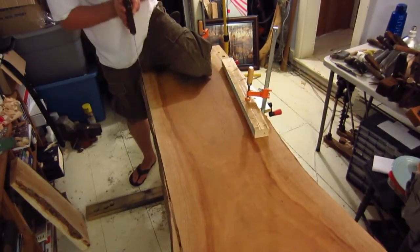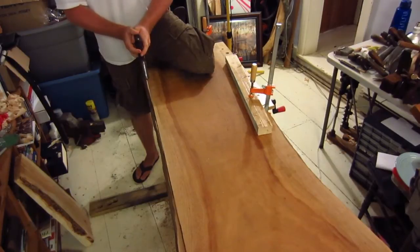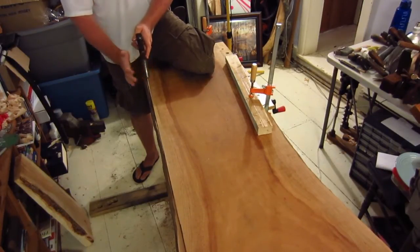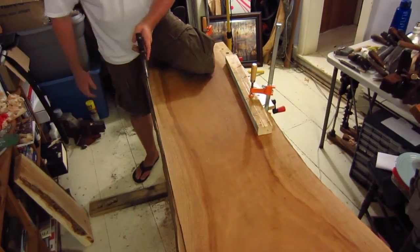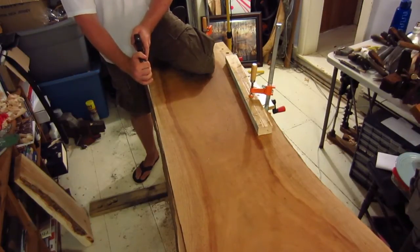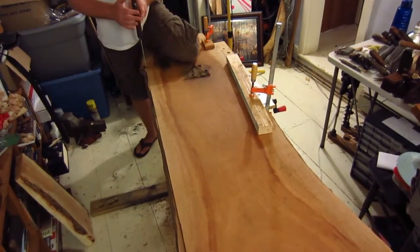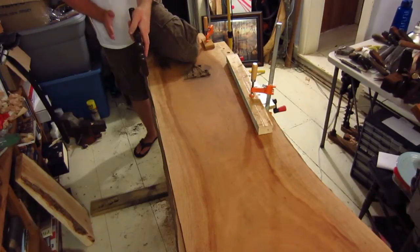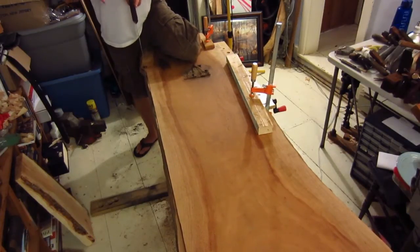When you're sitting right over the saw with it centered between your shoulders, you can use a nice two-hand ripping technique. Some people hold differently — there are a lot of grips. I have a D8 with an extra finger hole so you can put your thumb through and push. Being centered over the saw allows you to use the weight of your body instead of just your arms, so you get a lot of extra force without tiring yourself out. You always want to cut at an angle with the saw tilted back or forward. When ripping in the stance I'm using now, tilt it back — it's more natural and keeps the saw from chattering on the edge of the board.